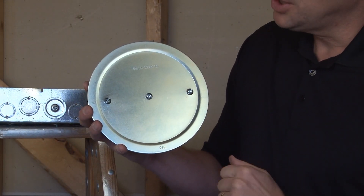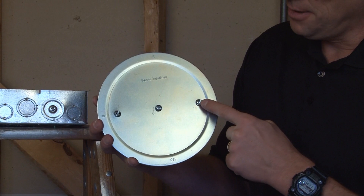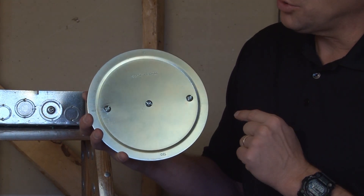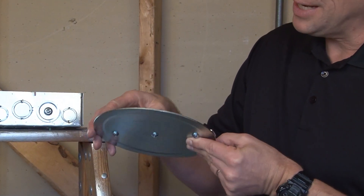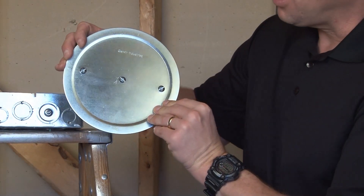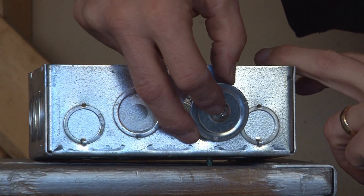To install this product, you remove one of three tightening screws on the outside of the plate. You then loosen the two other screws and create a gap between the backer bar and the flat plate. This will then allow you to slide the backer bar on the inside of the hole and drop it into place on the open conduit hole.